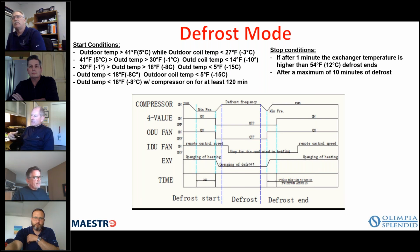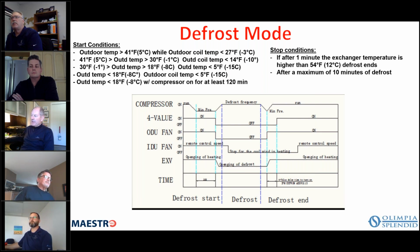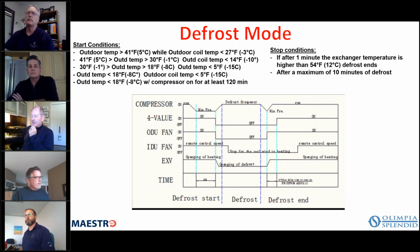or go into a central condensate collection system, that's okay in new construction. You could accommodate that if every unit was going to have that. But in retrofits, how do you deal with the condensate? You'd have to put a container or something underneath there for the heating mode. When it goes into defrost, you've got something to collect the drainage off the coil once it defrosts.